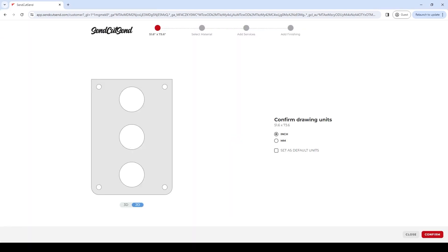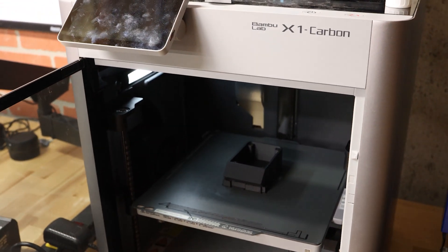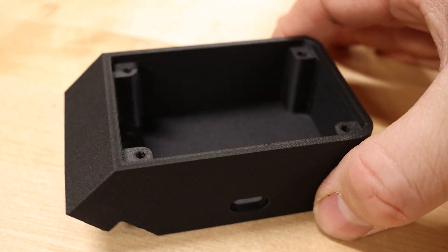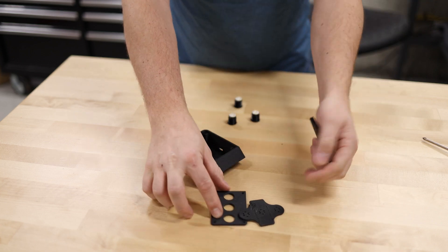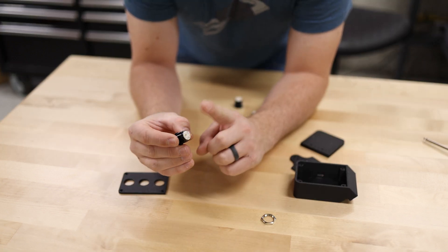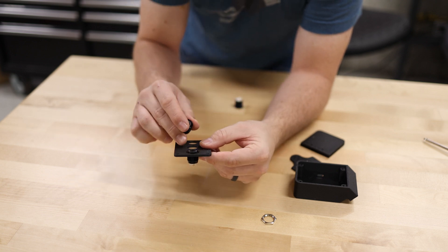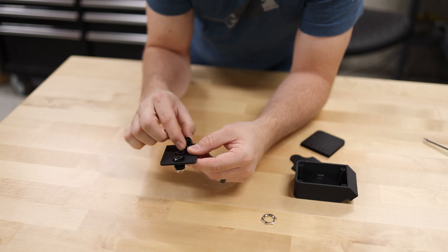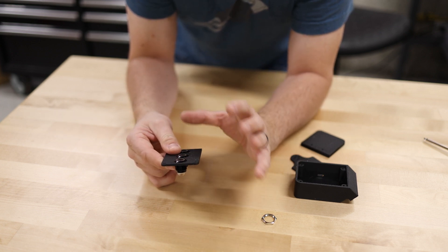At this point I'm ready to order my PCB, upload the design, and order the laser-cut parts from SendCutSend and electronic components from DigiKey. For the 3D printed parts I'm using my Bambu Labs printer with PETG carbon fiber filament — it turned out perfect. While waiting for the circuit board and laser-cut parts to arrive, I 3D printed some mock-up pieces to do a dry run. One design trade-off: the buttons must be slid through the face plate and soldered to the PCB, making it a permanent sub-assembly — there's no way to remove them without desoldering. That's a trade-off I'm willing to accept.